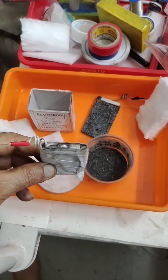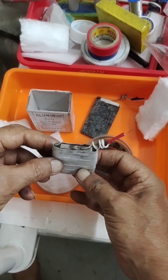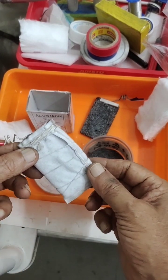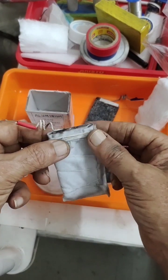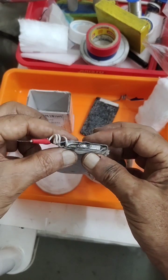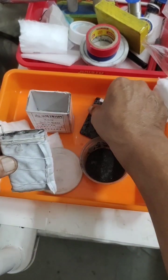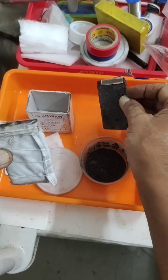After filling the graphite, carbon mix, and manganese oxide into the positive carbon plate inside the bag, I used ordinary paper twine threads to tie it — just for safety, to keep the shape tight. Extra loose material is made tight with additional winding on top as well. This is our positive electrode; the plain carbon plate is our negative.